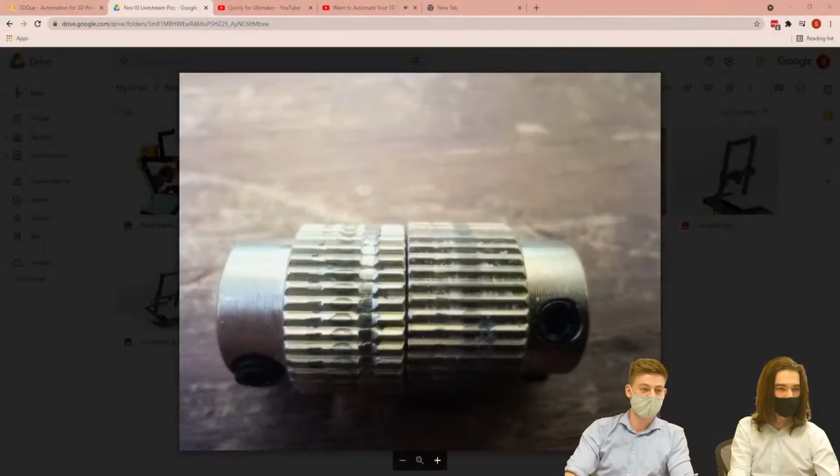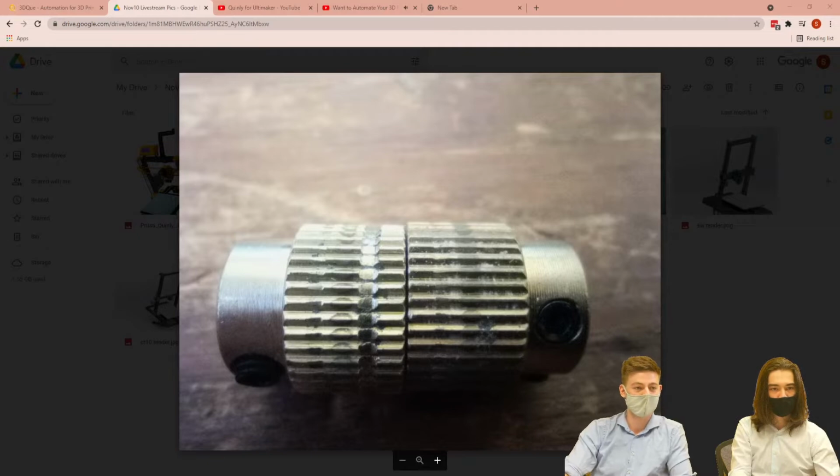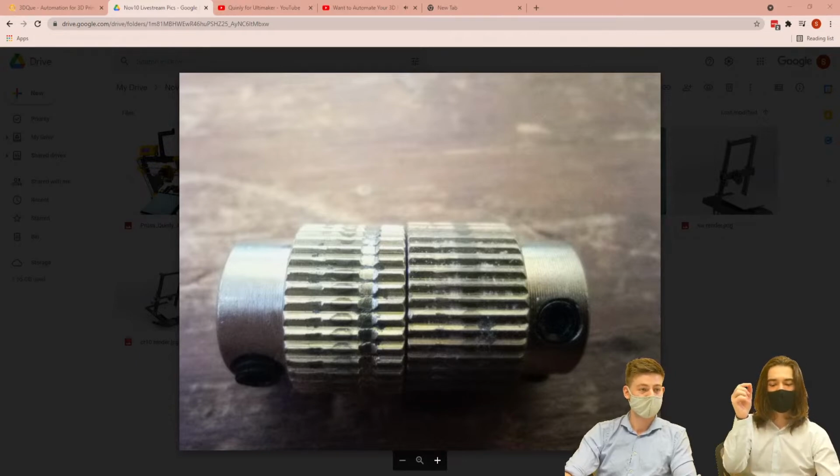Oh, but is this uncommon? No, well, this is what happened to us first. Before our extruder would wear out by sawing, it would destroy the teeth on our extruder gear. If you can see, the one on the left is totally ruined just by running miles of filament through it, and the one on the right was used a little bit, about halfway through. Ben said it happens to the aluminum extruder as well. Basically, the angle of approach of your filament has to be correct, otherwise it will just saw through your extruder arm.